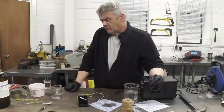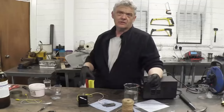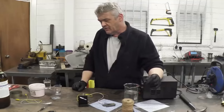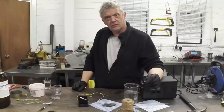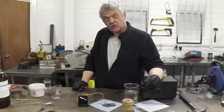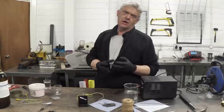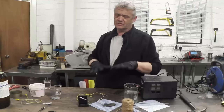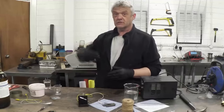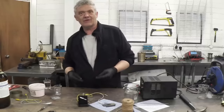Now, you make chromic acid, as I say, by making this stuff into a bit of a paste and then adding a lot of sulfuric acid at 50% concentration. And that will make your battery. And the battery is a zinc anode and a carbon cathode. And it will react the minute you put the zinc in there. So the chromate battery was always with a submerged carbon cathode and then the chromic acid electrolyte. And then in order to activate it, there was some kind of lever mechanism that would slide the zinc down into the chromic acid to start the battery.